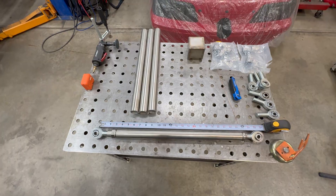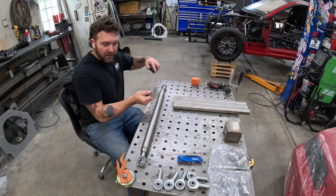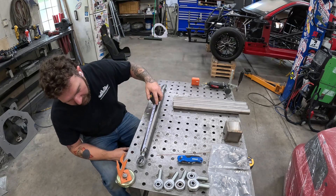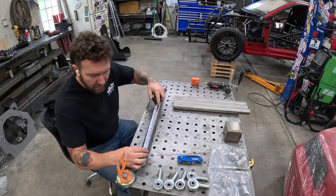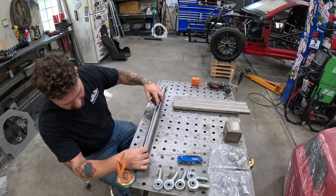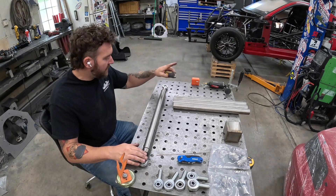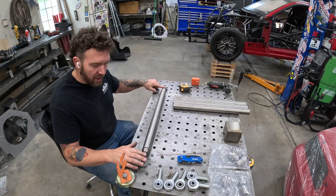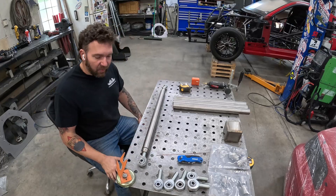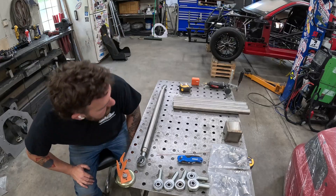Then we'll do a little welding on titanium. Generally when I set these up, I'll leave a little bit of thread showing here, and there should be a jam nut in here. The jam nut is about a quarter inch, and then I have about three-eighths of an inch of thread sticking out on each end. That way you can shorten it or lengthen it and still have appropriate thread engagement. So let's get these cut down and we'll start welding.